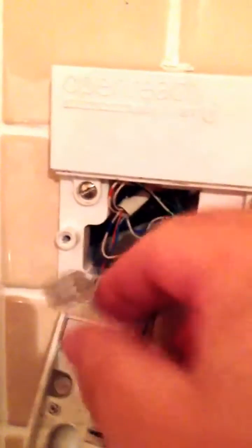There are a couple of things about this. First of all, what's happened here is that's a gel crimp. That's merely been done to extend the internal wiring because it's probably a bit too short. And there are two of those. Anything connected to this should be internal cabling. The orange cable here is your bell cable.